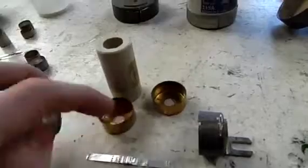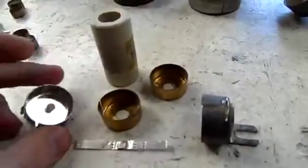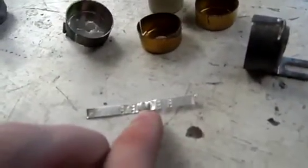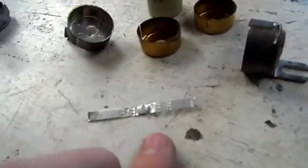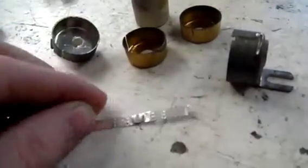There are four basic parts to a fuse: your outer ceramic housing, your sand, your caps — the inner cap which the strap is soldered to, and the outer cap — and then your strap, which is the main part of the fuse carrying the power. There's a lump of solder in the middle which, during an overload, melts and breaks continuity going open circuit. In a short circuit, the entire strap incinerates itself and breaks continuity, cutting power.